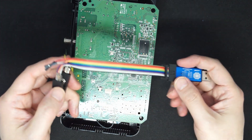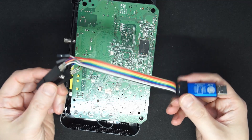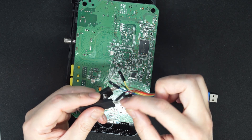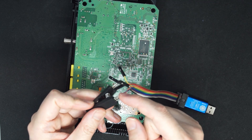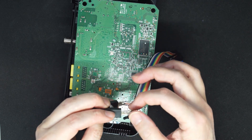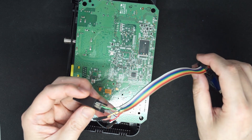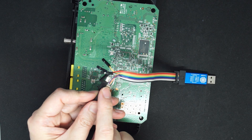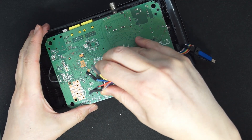In order to access the SPI flash here, I make a very simple connection. I take off the plastic here and use the plastic tape here. I only connect pin 1, pin 2, and pin 4 on one side, and pin 8, pin 5, and pin 6. This is DI, clock, 3.3 volt from the U-Link and GND, then the CS and the DO. To make the proper connection, we only need to clip on like so.